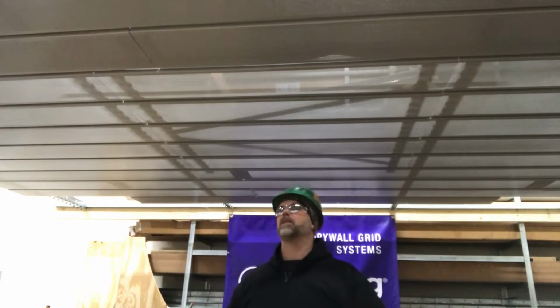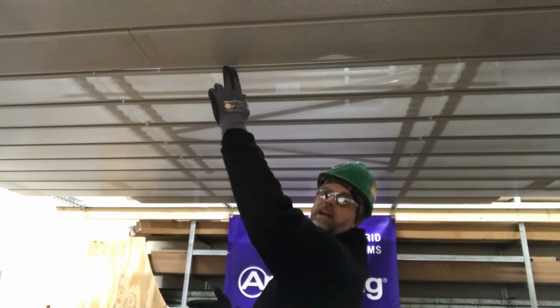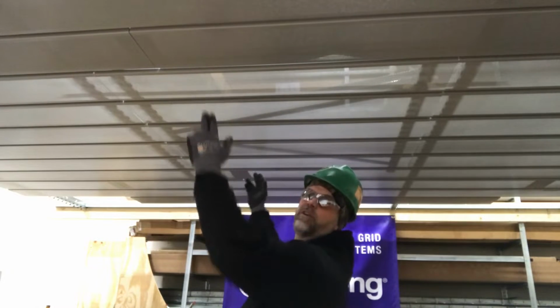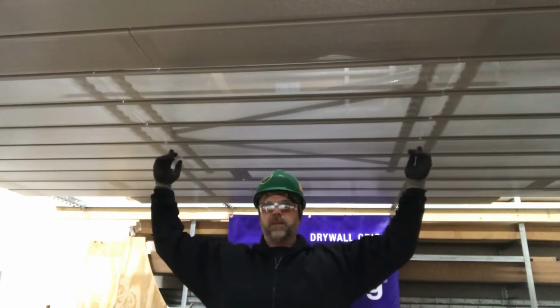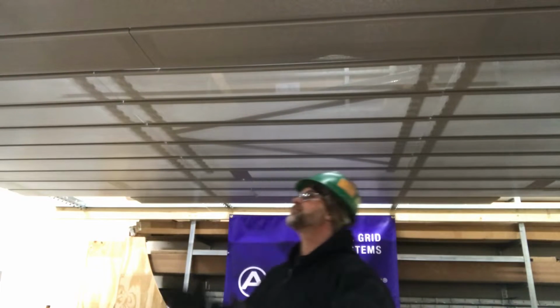So to remove this panel, since I made it full-size panels in one direction, the seam is actually hitting in the reveals. So you cannot tell in the reveals where the access panel is. The only area you're going to see where the access panel is right here, where you'll see some small seams going down the ceiling system, which look like a butt joint.